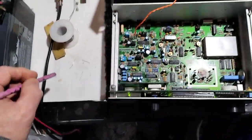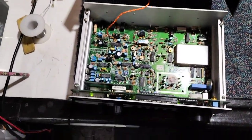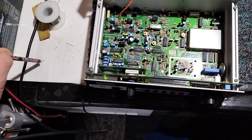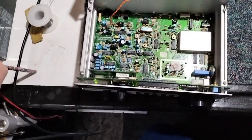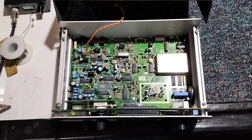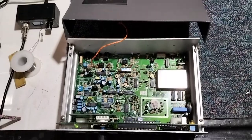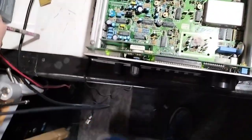Initially it would work somewhat above about 18 MHz but wouldn't operate below that. Looking at the output from the local oscillator, if you went up and down the 1 MHz steps it was going up and down fine, but once it hit a certain point it wasn't. So the PLL hasn't been running properly.